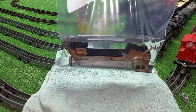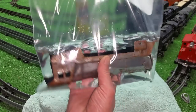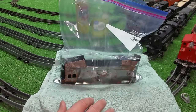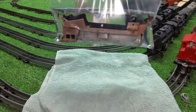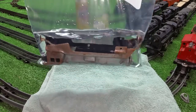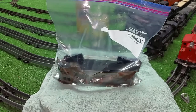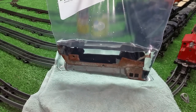We'll check it in 24 hours. I'll do a video tomorrow before I take it out of the vinegar so you can see the difference. It is fairly rusty, but this is a really simple way to do it. The nice thing about it is you don't have to do anything physical — you don't have to sandblast it, sand it, scrape it, or scrub it. The vinegar will take the rust off and also take any remaining paint off. Then you just rinse it off, deactivate the acetic acid with some baking soda, let it dry, fill in the holes where the markers were, cut the new slots for the new stack. A few minutes' work and you can have a really custom Marx locomotive that in this case was absolutely free.